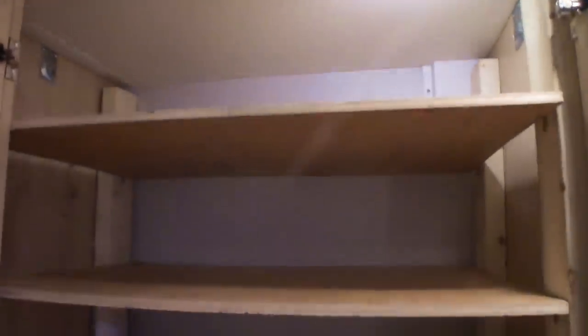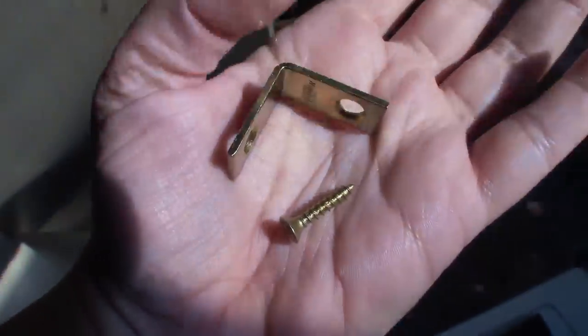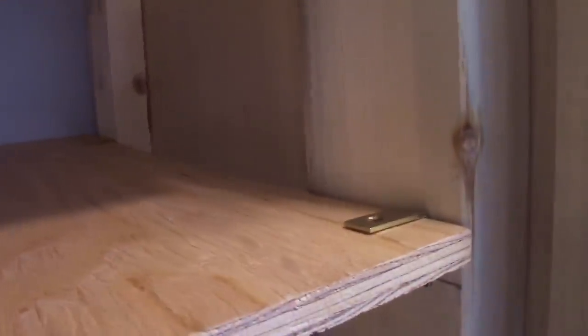As I'll show you in some pictures, we got the 2x4s up, got the pegs in, put the shelves in one by one. What I realized then is that even with stuff on top of the wood, my shelves were going to be bouncing up and down because they were only laying on the L bracket. So what I did later is I took my remaining L brackets and drilled them in upside down, so that I had a metal arm underneath the wood and on top of the wood so it doesn't move at all.